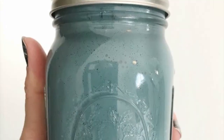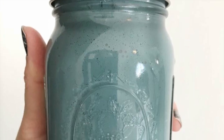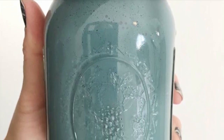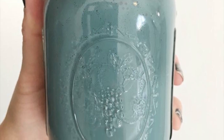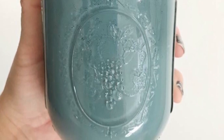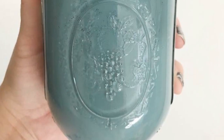Now milk paint comes in powder form. It is 100% VOC free, all natural. And all you do is mix it with equal parts of warm water. And I like to mix mine in a mason jar. Just make sure you shake it really well until it's the consistency of a melted milkshake. And just apply it with a regular chalk paintbrush. And I will actually put the link below of where I got my paintbrush because it's very inexpensive and where I also got the milk paint.